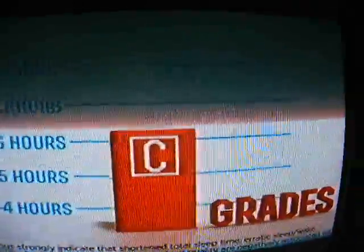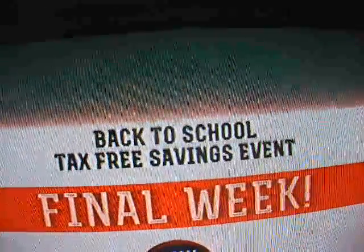But anyway, I replaced those capacitors, I adjusted the vertical size control, I adjusted the focus control on the flyback transformer, I cleaned enough cigarette paste off of this TV screen to start my own cigarette factory, about 25 years worth, and that by itself improved the picture a great deal. And I pretty much re-soldered everything in the vertical, horizontal, and power supply circuits. Those areas of the board are hotter than any other area of the set, which means they're more susceptible to connections breaking loose and parts failing from high temperatures.